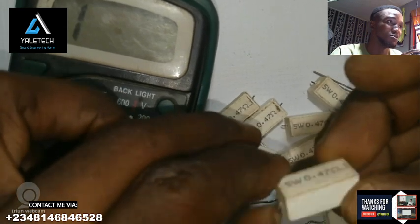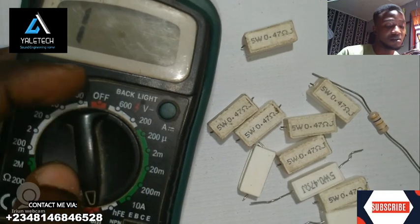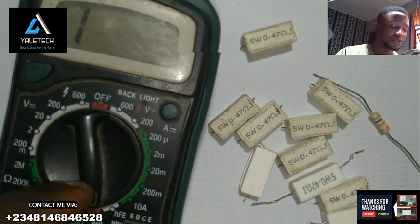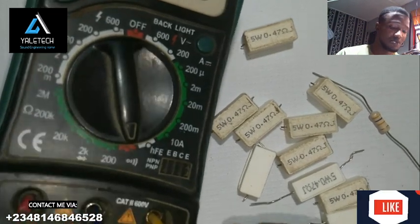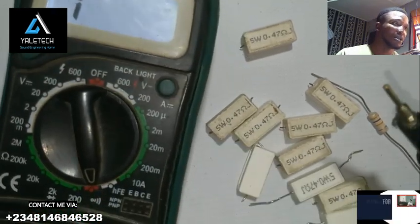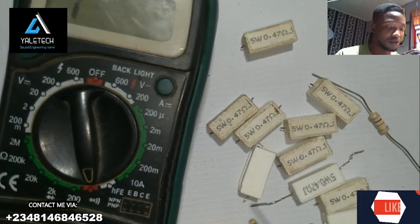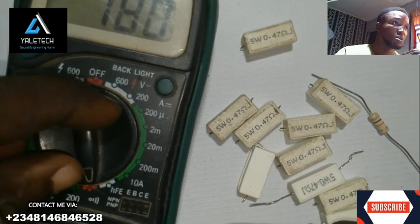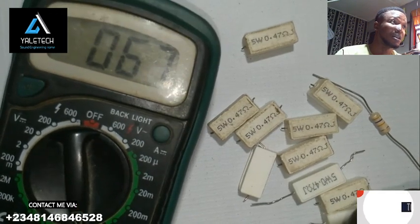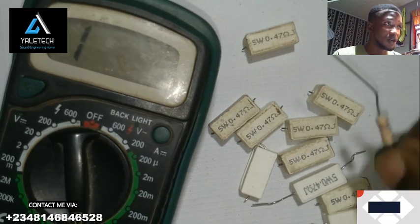This choke has more power in terms of wattage rating. Without wasting much time, I have my multimeter with me. Whether it's analog or digital, it's not a problem — just find your way around it. If you are using a digital multimeter, set it to continuity. My multimeter is currently set to continuity right there. If you don't know how to do that, check my channel playlist — I have a lot of videos on how to use a multimeter. Once your multimeter is set to continuity, touch the probes to each other and you must hear a sound, telling you there is continuity.